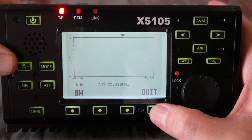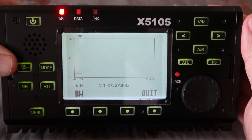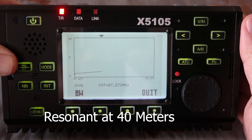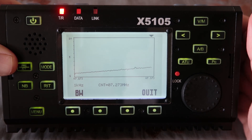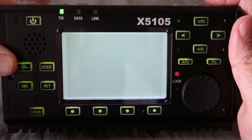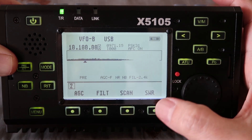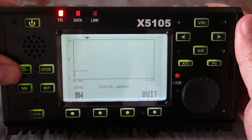Now let's go to the 60 meter band — not resonant there either. Now here's the 40 meter band, and yes, it is resonant on 40 meters, which makes sense because that's what we cut it for — 33 feet to match the 40 meter band. Now it's going up at the high end of the frequency, so it's probably going to match nicely at the lower end. At 30 meters, it looks like an SWR of about 2.